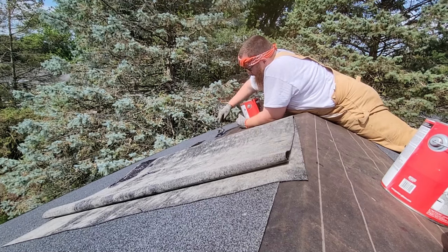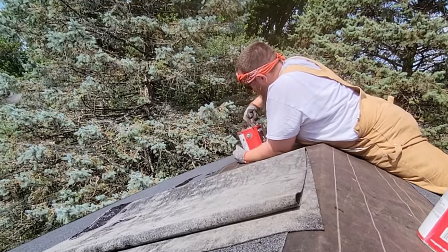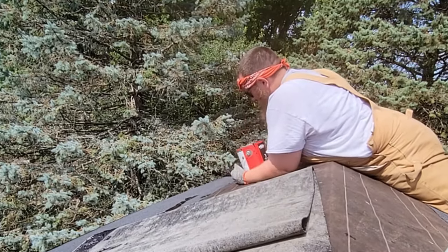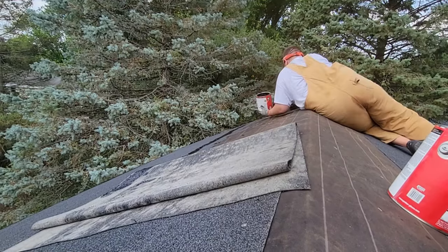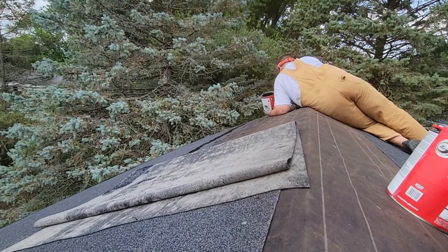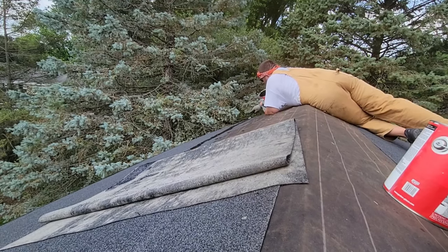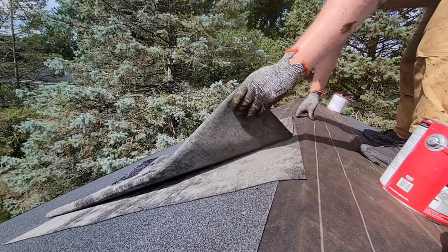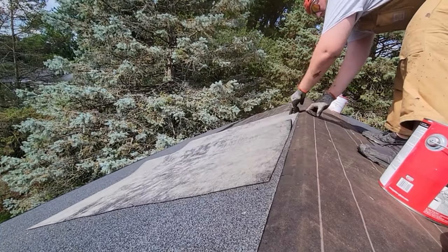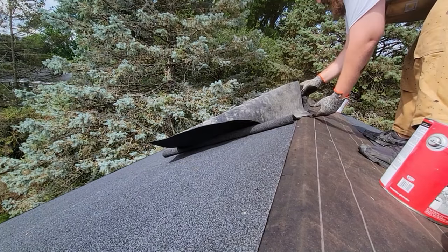So I started the edge just like I showed you before — laying down the roof cement and nailing it every 3 to 4 inches. Now as you roll this out along the previous section that you put down, you're just hitting those marks that you made with the chalk, so you know where to put the roof cement and where to align that next edge of your rolled roofing.